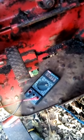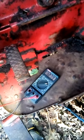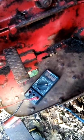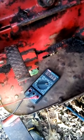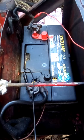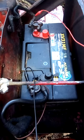For me now it's reading 14.4 to 14.5 volts — I did just get 14 volts before with the battery a bit more dead. It shouldn't go above 14.5. Before, it was going all the way up to 15 running it backwards. So if you've got that going on, you might have to bite the bullet and go back to positive earth, which is weird, but that's the way the tractor was designed. Cheers.